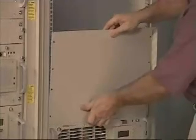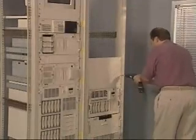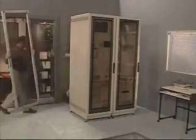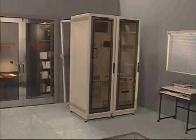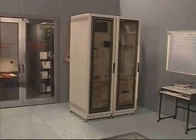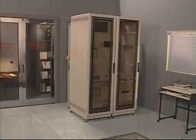Place the panel across the front braces of the rack and secure with the Phillips oval head screws and standard cage nuts provided. To reattach the doors, insert the top and bottom pins back into the hinges until they click into place. Make certain the thumb screws on the component faceplates are securely tightened before closing the doors.